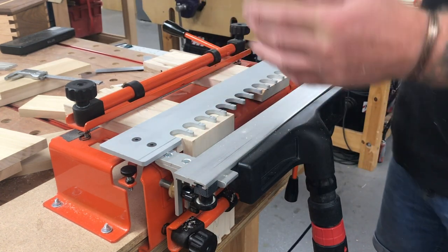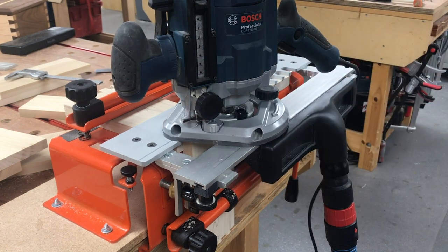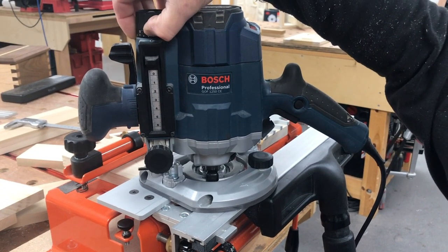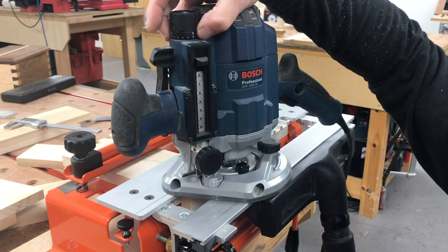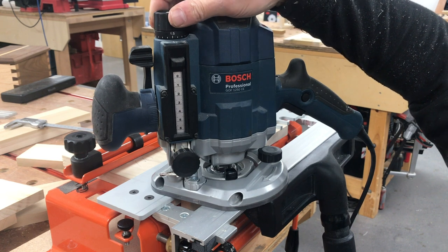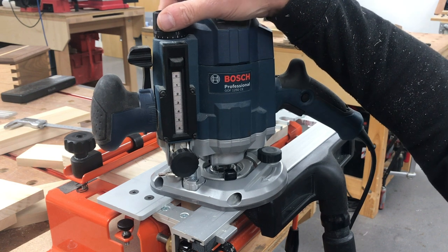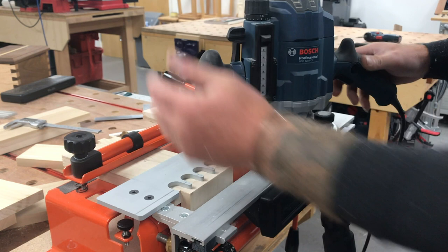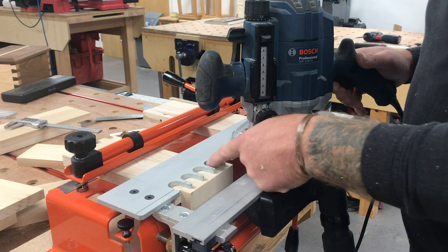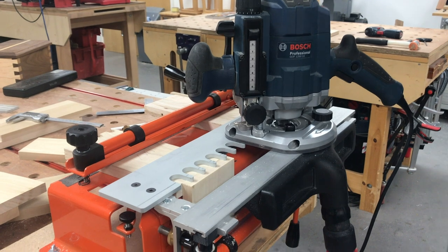Now I don't need to make another 11mm line, I just need to lift that cutter up, like I said, a very, very small amount. All right, so we've got a scale on this one, so if we zero off to a point there, zero. So if I'm going, there we go. And we'll do another scribe cut, just the same. And then we'll come in and do it just the same way. And we'll have a little test for fit. Right, so we are ready to go again.